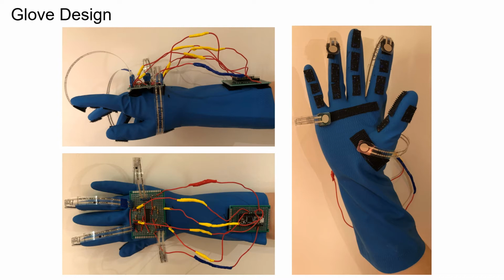The sensors are connected to the glove via Velcro, which allows for an adaptable arrangement of the sensors. There are 4 sensors on the glove, with a standard arrangement having them placed at the index and ring fingers, as well as on the upper palm and ball of the hand. This placement was determined during testing to provide the best distribution of contact across the hand to best represent the forces present. The glove itself is a common latex-free dishwashing glove. Each sensor also employs the use of a puck to evenly distribute force across the sensing surface and away from the sensor edges, ensuring proper sensor operation. We tested a variety of pucks with different levels of compliance to examine how puck compliance levels affect the forces measured by the glove.